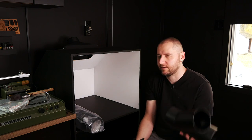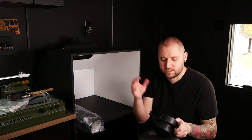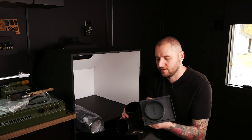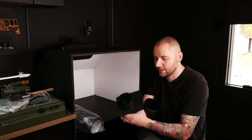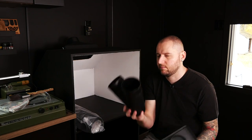So I think I'm gonna leave this out for now and just directly hook it up, and I can always add this in later. Part of the reason I'm not bothering to connect it right now is that I ordered all these parts from this company called PowerTech. It's specifically extraction air parts, like it's meant for dust stuff in shops. Got these blast gates, but the really silly thing is that they didn't sell couplers to attach part to part. You can only attach hose to the pieces, and these blast gates require a lot of force to open and close, so I don't want them just in the middle of a floppy cord. I want them connected really securely. So I gotta try to source out a coupler or inside connection that will work for these. They're an odd size. They look like ABS plumbing, but they're not. I'm gonna have to go to a store with one of these and try to get something to fit.